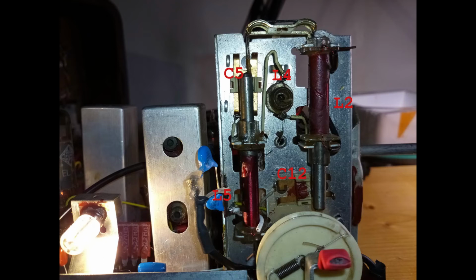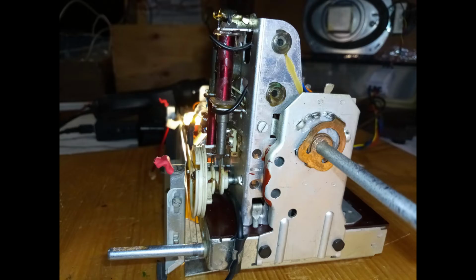With the radio under restoration, it appeared impossible to align the reception to the values reported on the dial scale, even trying different values for the intermediate frequency transformers. Therefore, for every band, the alignment has been made only for a frequency around the middle of the scale, adjusting the components to get the maximum output signal.